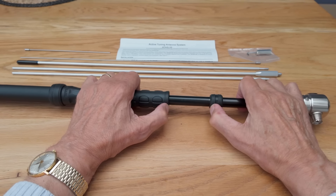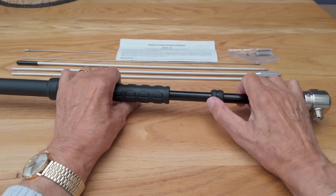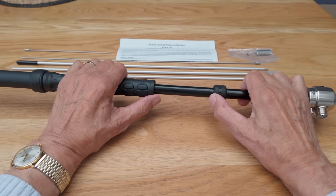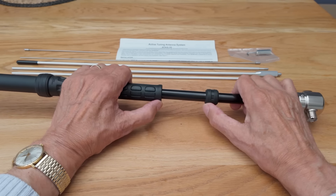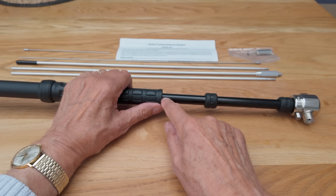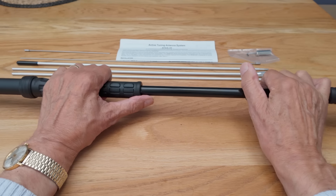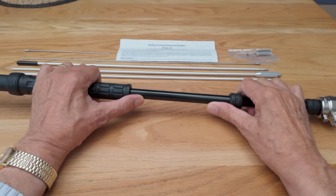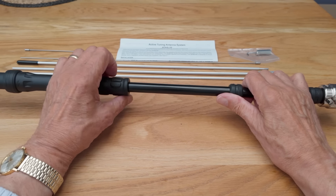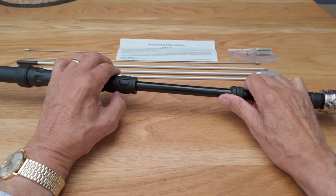If you look at the gap between the coil sections, that's something you can measure. Once you've resonated the antenna — say on 20 meters — you can measure that position with a tape measure, or cut a small length of wood that fits in there so you can quickly get back to 20 meters. Likewise on 40 meters, with the antenna almost fully extended, you can have some reference to get yourself in the ballpark area and then do fine tuning either by rotating or dragging it down. The fine tuning is always done using the coil adjustment.